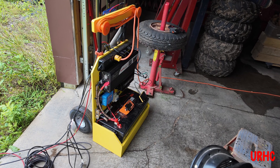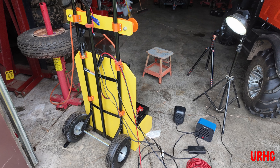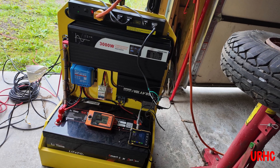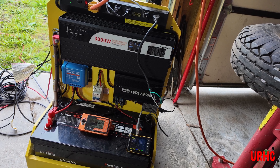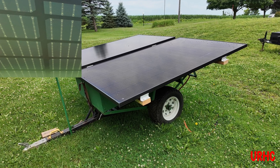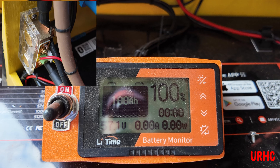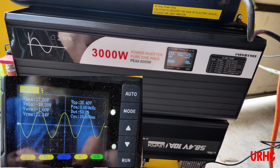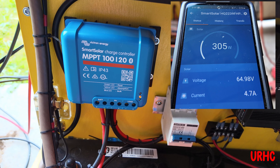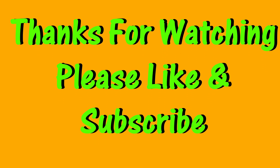This is just a crude starting point and I wanted to show you what I'm working on. I'll have a better video once I verify everything works and figure out exactly how I'm going to proceed to the next step. Essentially all you need is a battery monitor to tell you what's going on, a power inverter to make AC power and convert the battery DC to AC, and a charge controller to manage the power coming from the solar panels — either sending it to the battery or to the load.